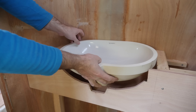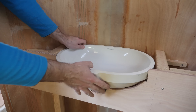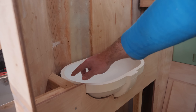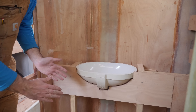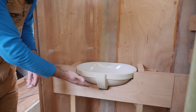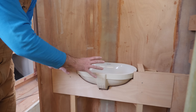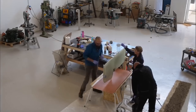After a little bit of fiddling about I have gotten a reasonably good fit here. As you can see the sink is not lined up perfectly right now, but that is okay — when I say not perfectly lined up I'm talking about height wise. It's sitting a little bit below what's going to be the countertop, but that is on purpose. Unlike a regular bathroom, this bathroom is going to be pounding into waves, so I want to make sure this is really well supported. The best way I could think of doing that is by coating this in multiple coats of PVA and then using it in place to cast a sort of epoxy foam cushion for it to sit in. The PVA should make sure I can remove the sink again, and the epoxy foam doesn't exert a lot of force when it's expanding.